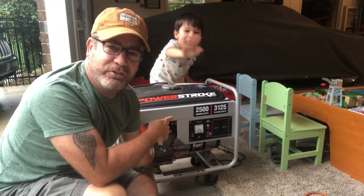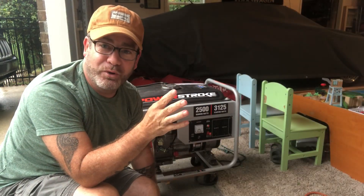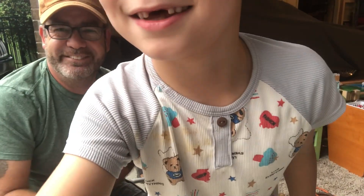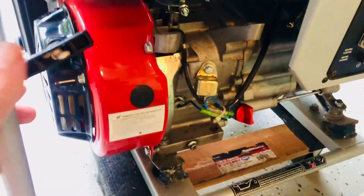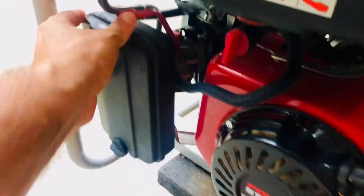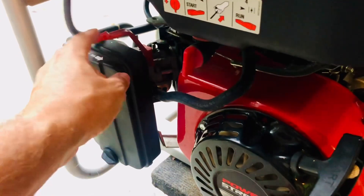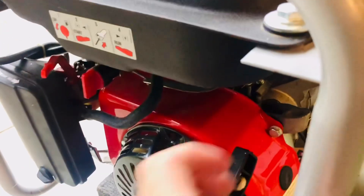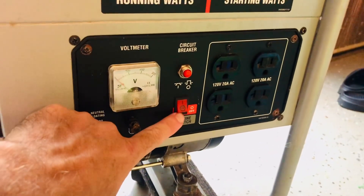Keep this unit outside of the building at all times. If it's outside your garage, put it outside and shut the garage door. On this particular unit — every unit is a little different but very similar — you always want to check your oil down here to make sure you have oil. You don't want to burn up your motor. Come around here, turn the fuel to on, put the choke to start, then simply pull the cord until it cranks. Once it runs for a minute or so, take it off start and put it on run. When you're finished, slide over to the control panel and hit the engine switch off.